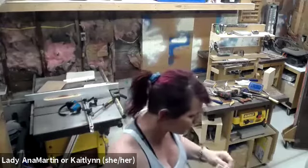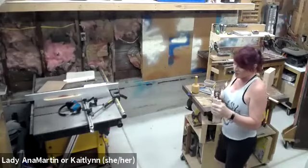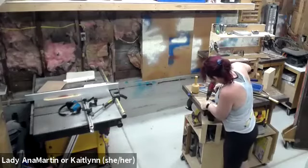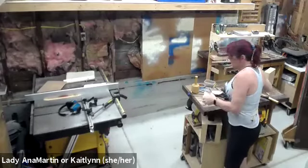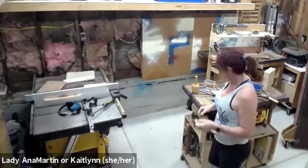And the reason is, anywhere past the material that the head of the screw goes is not holding wood. If it's buried down deep inside, it's not holding the wood anymore. You've just basically made the wood thinner. So if it was a piece of 3/4 inch lumber and you buried the screw head 1/8 inch down, you've now got 5/8 inch lumber instead of 3/4.